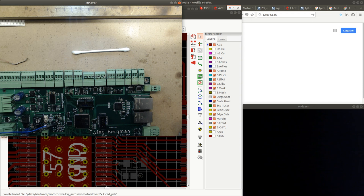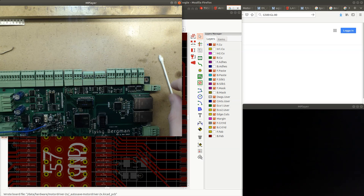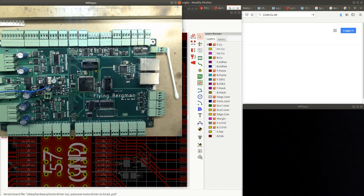Okay, I found the short. Good news. So what I did was I connected the power to the 3.3 volt rail, and I adjusted the current limit on my power supply so that I wouldn't get any overcurrent fault, and I slowly increased the voltage until I had around 2.5 amps running through the board,